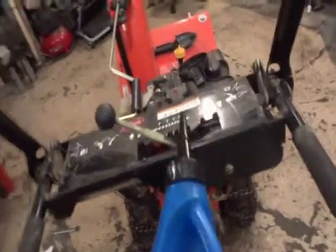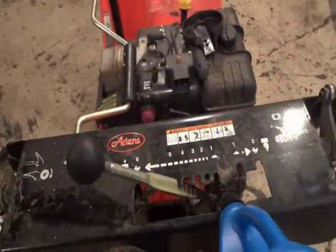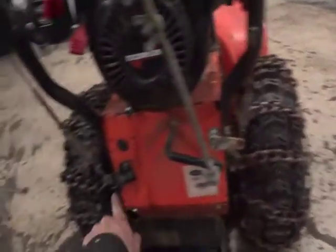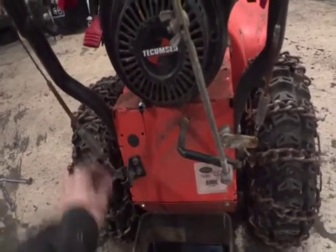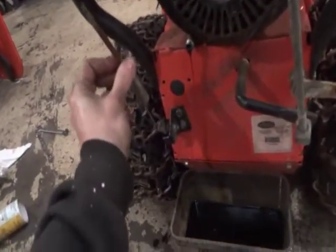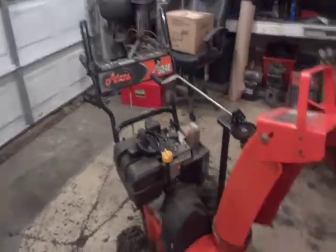A little bit down to where your gear selector is. We're eventually going to pop off that drive box in a little bit. I'll show you why. A little bit onto here, a little bit here, a little bit on your little slider down there. If this needs to be adjusted, adjust it. It's only the little bolt right down there. And yeah, that's what you're going to want to do there with a little bit of gear oil. So I'll go ahead and do that real quick.